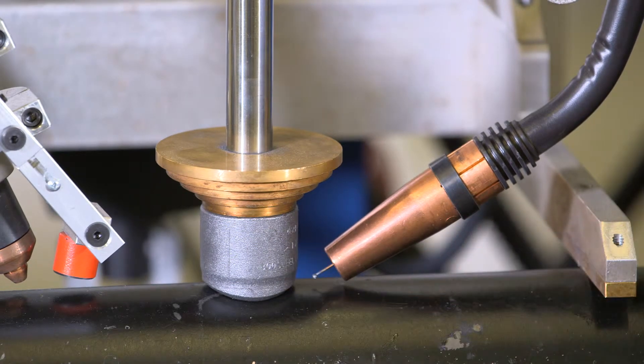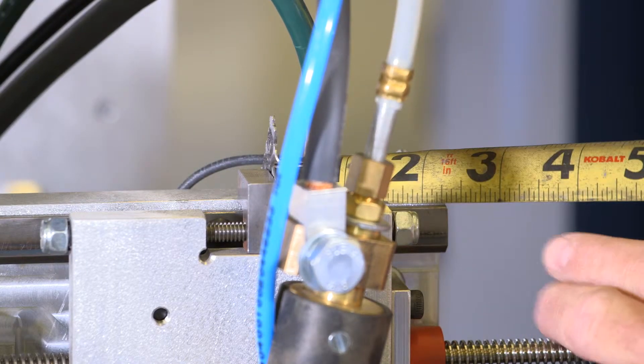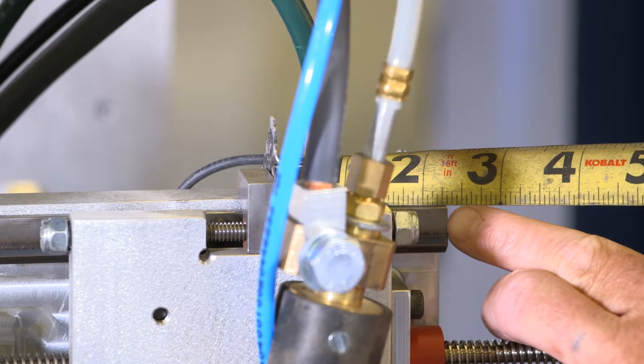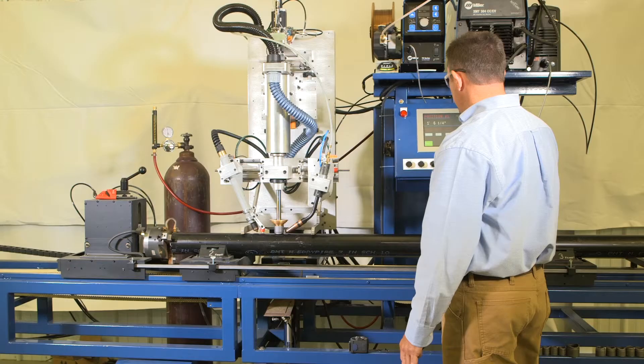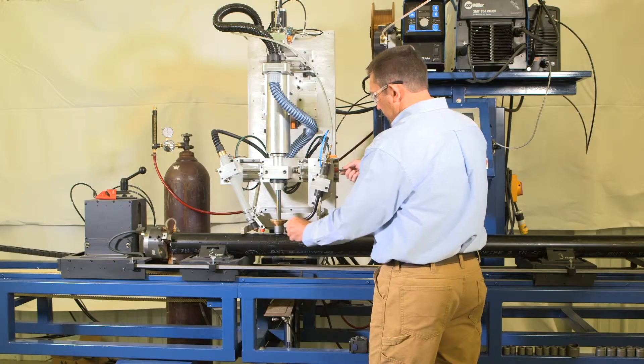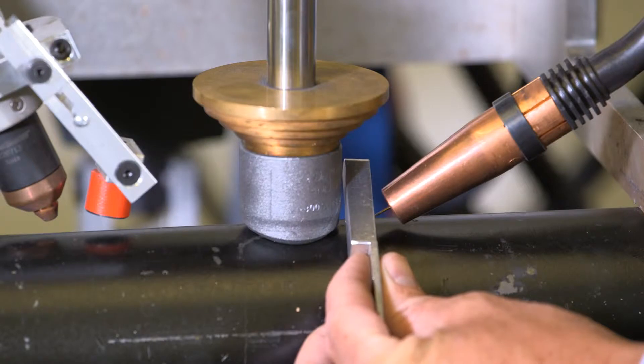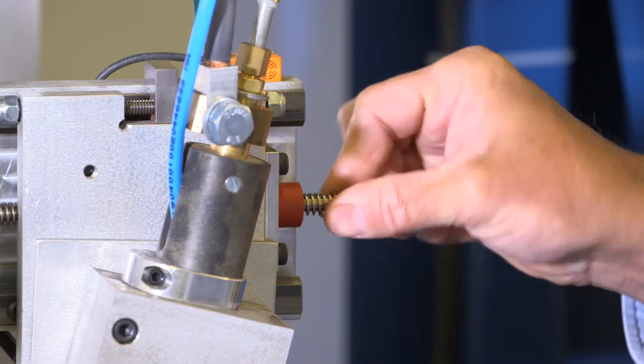To adjust, get a reference from the home block to sensor, then turn the motor off. Adjust the lead screw in or out to fit the go/no-go gauge between the nozzle and outlet. Turn the threaded rod to take the home block back to the reference measurement.